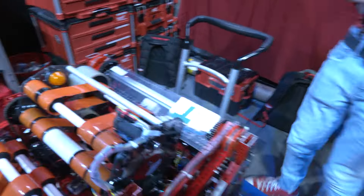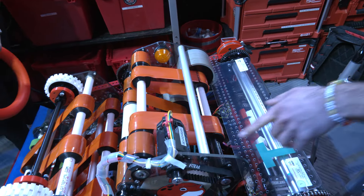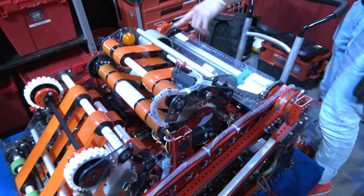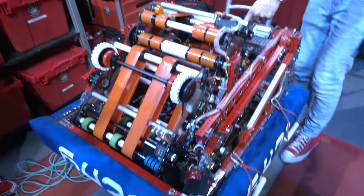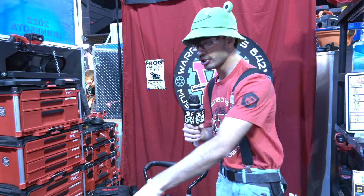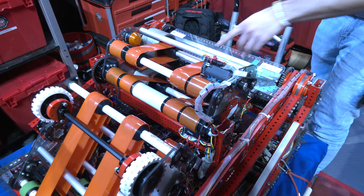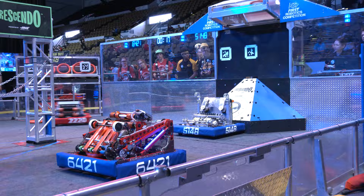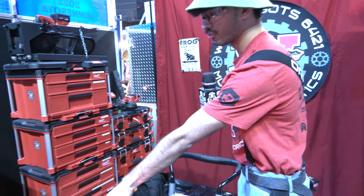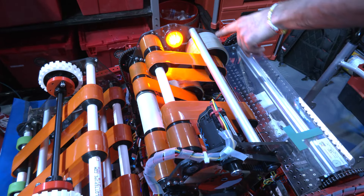A lot of teams have been talking about wheel configurations — what made you choose this type and what did you experiment with? Originally we had no belting and used stealth wheels on our feeder shaft and Colson wheels on our shooter shaft with wheels on both sides. While that gave us more power, it made shots a lot more inaccurate. We eventually switched to belting — it used to also be chain, but we were having problems with chain so we switched to belting before our first pre-season competition. Because of the Colsons we weren't getting enough surface area, so we switched to stealth wheels here, which transfers the force across a bigger area.